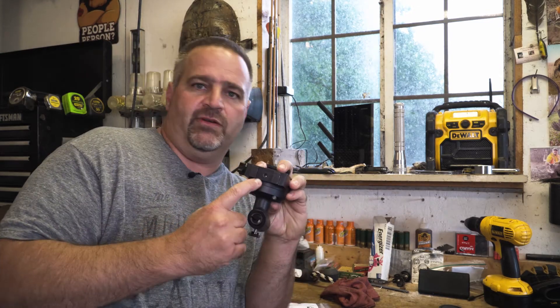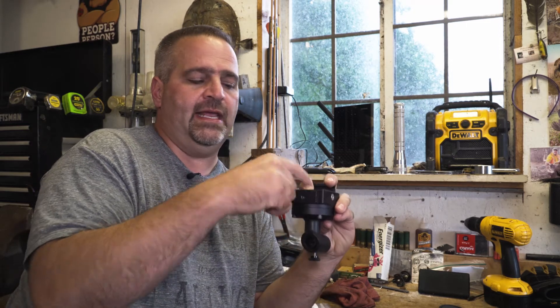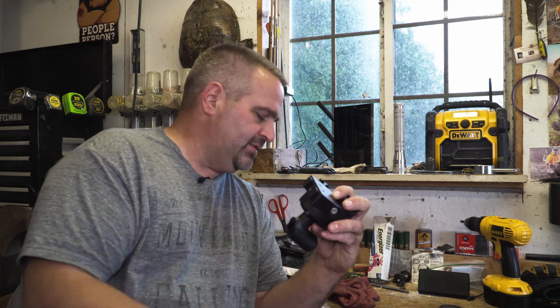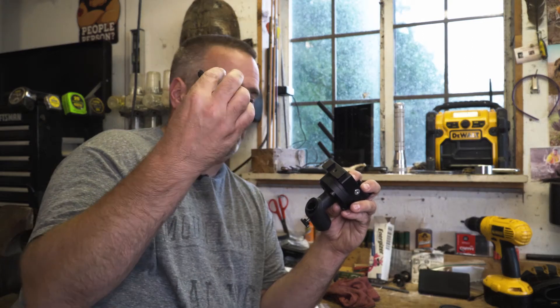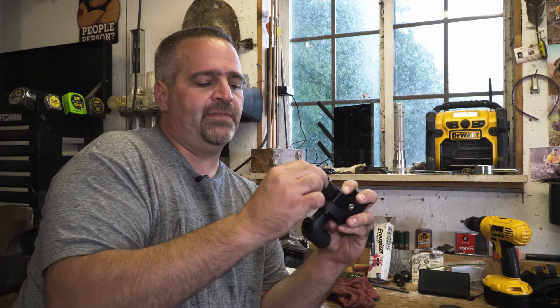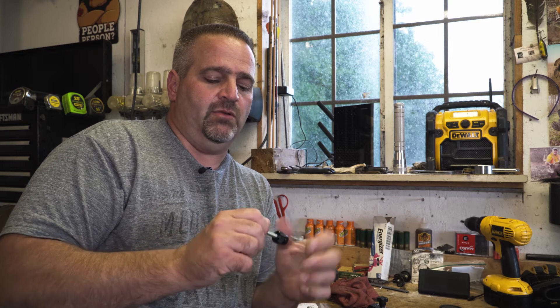On the bottom of the new 3.0 base is a drilled and tapped blind hole — a blind hole meaning it bottoms out to nothing, so there's nothing you're going to get into internally by going up into this hole. It's a quarter-20 — that's the same thread as the thumb screw they gave me. I found a two-inch quarter-20 machine screw in my stuff. I painted the head black — I just didn't want shiny. It threads all the way in and bottoms out. The problem is it's a little too long; I need to cut about a quarter to three-eighths of an inch off of it.